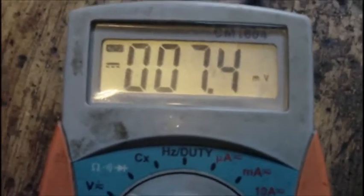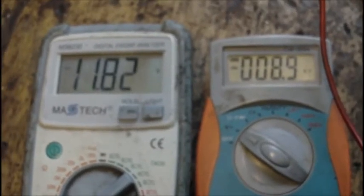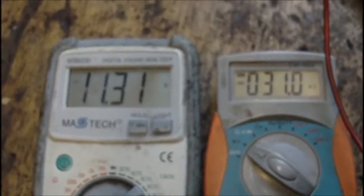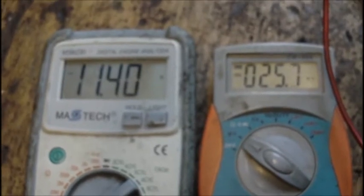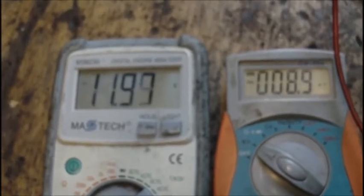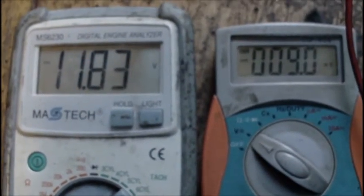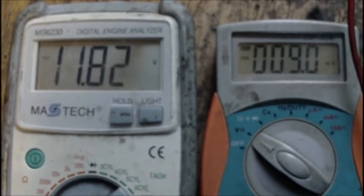I'm going to put a voltmeter onto that battery. We've got voltage on the left and current on the right. Shunt field off — build up some RPMs, they're nice and fast — and on. Holy crap, we just regenned! We just regenned. Well, that is interesting — this I was not expecting. Because we're still going through the series field. So how come I don't have to swap the series field?